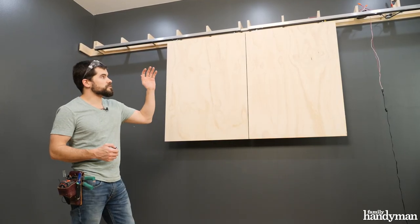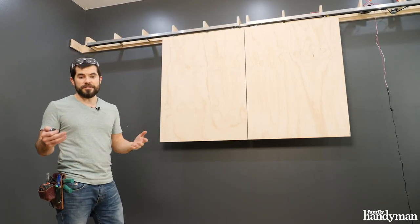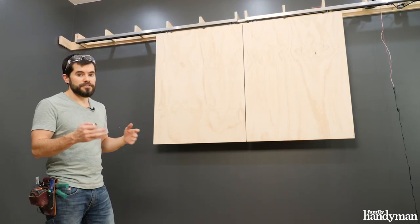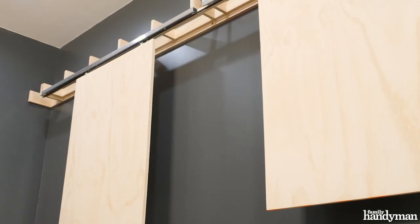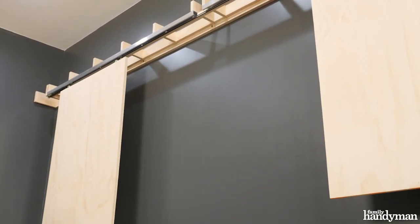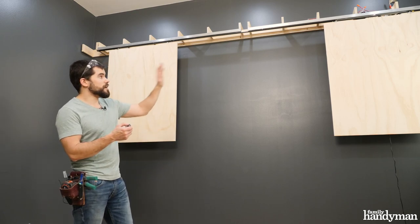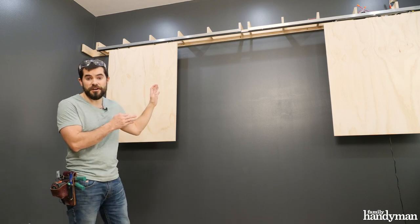So I've made my connections to the transmitter and the motor, hooked it up to power, and I just want to see that the connections are made correctly and that the belt is tensioned right. Here's the moment of truth. It works great. Now I have to clean up the wiring, add some limit switches in there, and then seal off the shelf.